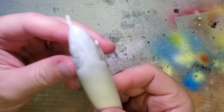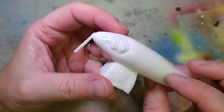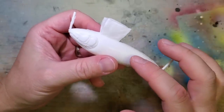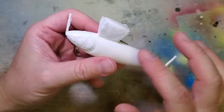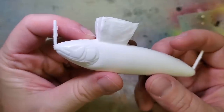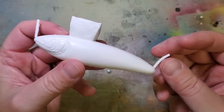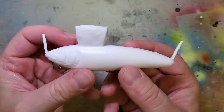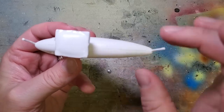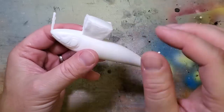Let's get in close so you can see some of the detail — that's a pretty good copy. If you have any blemishes or problems you can patch it with some instant cure and baking soda, then sand it and you won't even know it was there. Before doing anything, let it cool down and harden up — it's still a bit flexible right now. Once fully cured, you can sand off the ridges where the two mold halves come together, cut off the sprues, and cut off the funnel, then sand it just like you would a wooden lure.